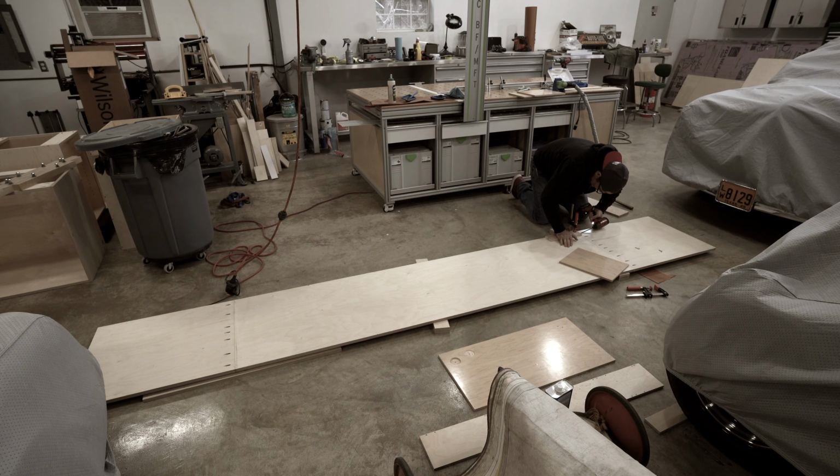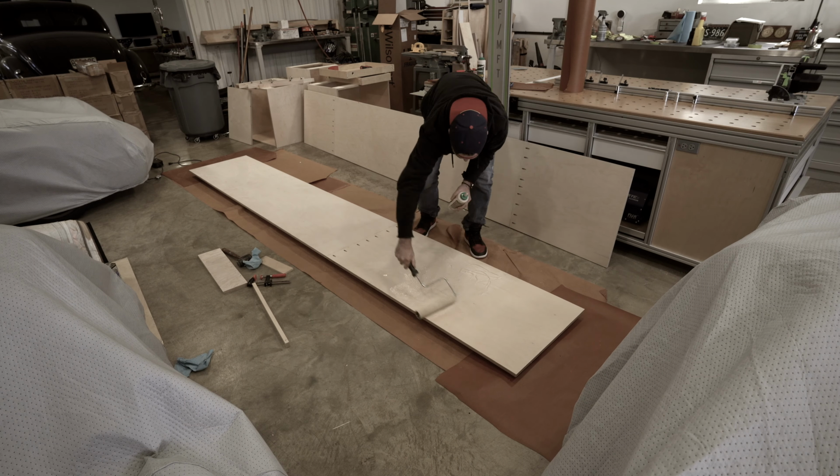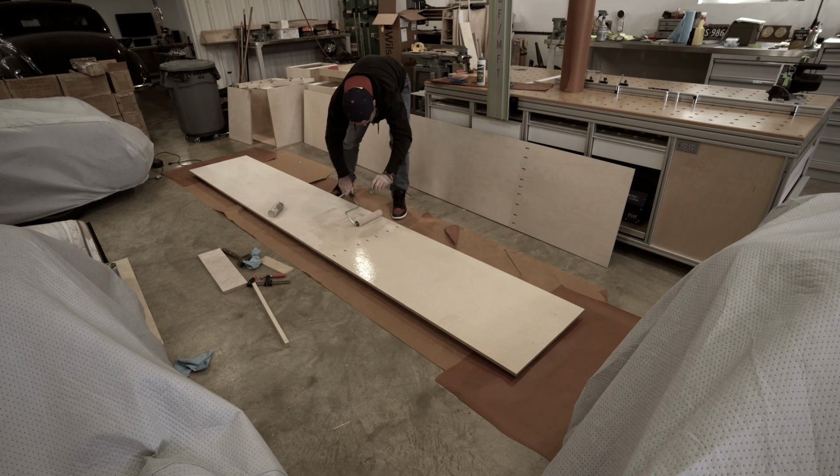I was a bit skeptical this would work, but once done, I was left with 2 panels that were around 15 foot wide and 24 inches deep, and could start laminating them into one. After sanding the mating surfaces to 160 grit, I rolled out a liberal amount of glue and then laid one layer on top of the other.